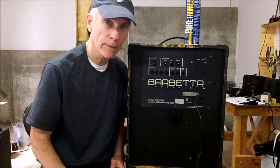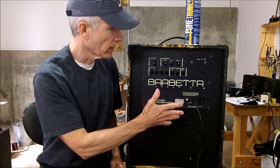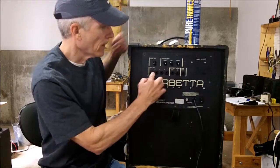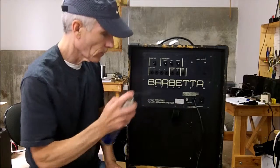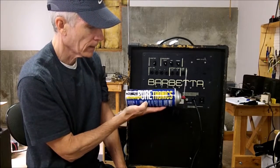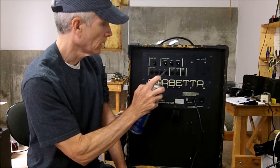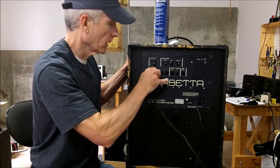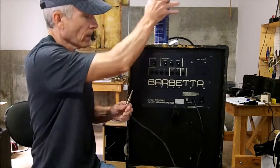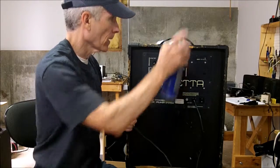I've got the panel back in the cabinet with three of the eight screws — just enough for testing. If there's something else wrong, using only three screws will save me time if I have to take it back apart. The pots are cleaned; now we want to clean the jacks that were intermittent. This time I'm going to use a plain electronics contact cleaner without lubricant. I'll spray some cleaner into three of the jacks and then work the plug in and out several times to make mechanical contact.